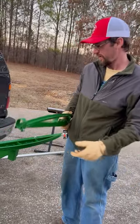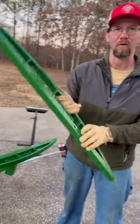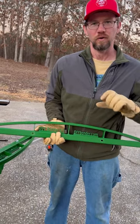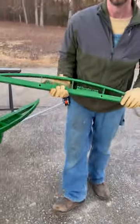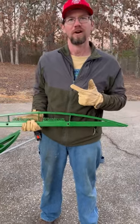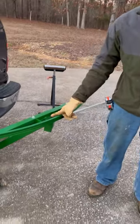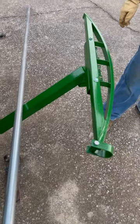We're out here and we've got to start bending the pipe for the hoop house. The reason I have two benders is this first one is a 14-foot hoop bender. A week or so ago we started bending and the table it was mounted to broke through the torsion of us trying to bend the pipe. So that brought us back to the drawing board. Also during that process it clicked in our heads to measure our gates — all of our gates ended up being 14 foot, so a 14-foot hoop house would not fit through the gate. We ended up having to buy a 12-foot hoop bender with the hitch attachment. Maybe this will be a lot better — we're about to find out.